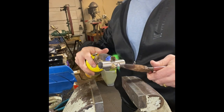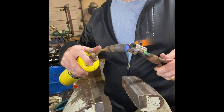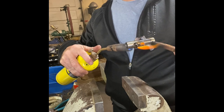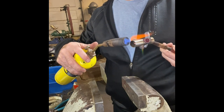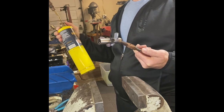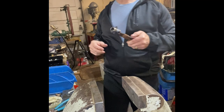I'm really only worried about getting the ends of the tubes right now — I'm not trying to heat the inside of the tube up. I'm working from one side to the opposite side so they just start to turn orange; I do not want them to be bright orange. Then I move to the next tube. When you're doing the initial annealing you're just trying to soften the sides of the tube so that you can get the tooling in there to open it up.